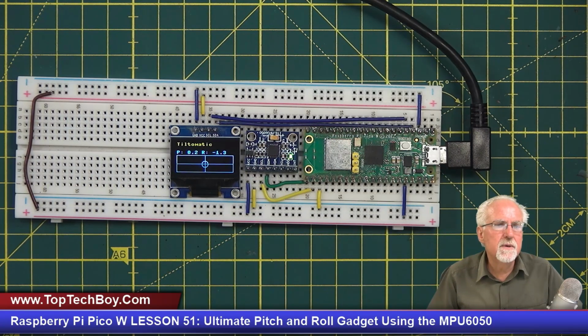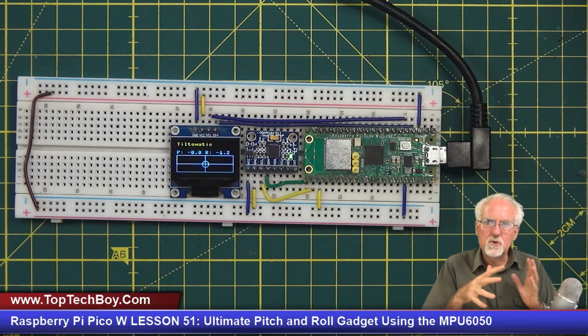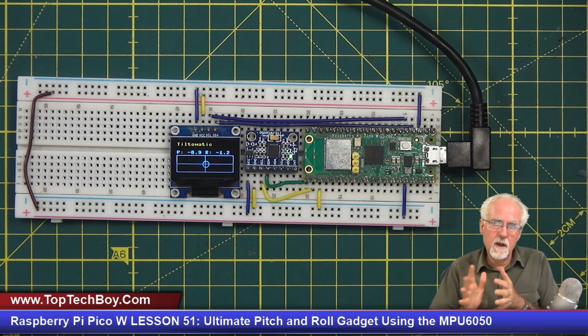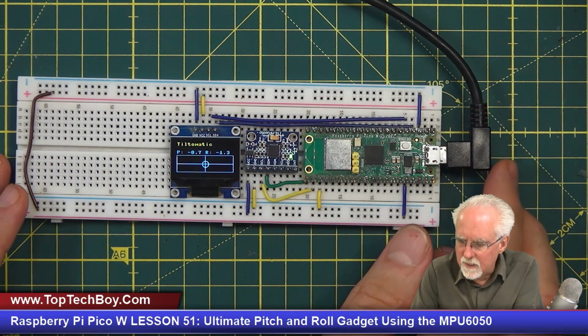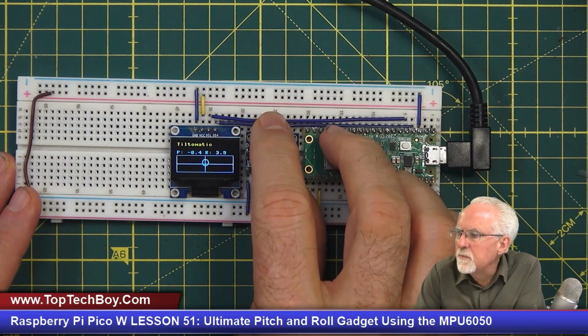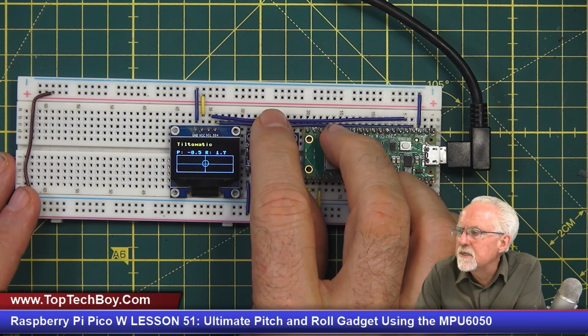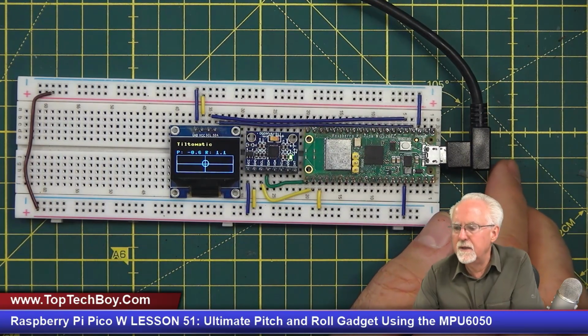And which gyro was that? That was the X gyro. So it's drifting off, but then our error compensation drives the error out, and now we are here. And this is saying that we have a roll of -1.2, and you see that this kind of wobbles a little bit, so you could be off by a degree.